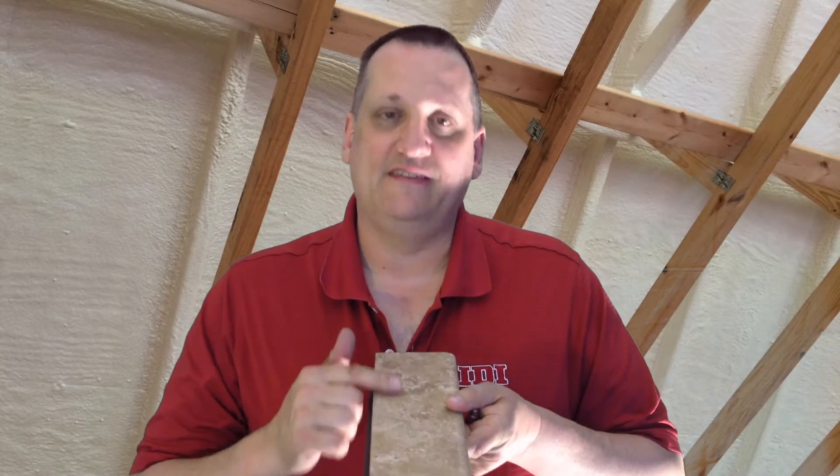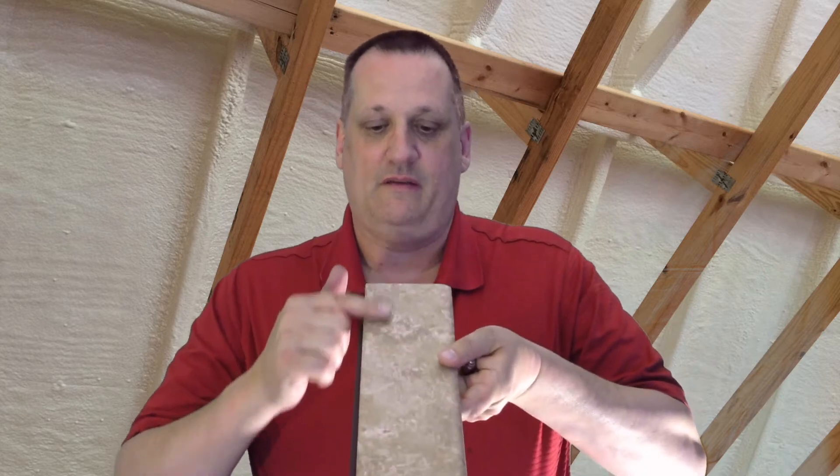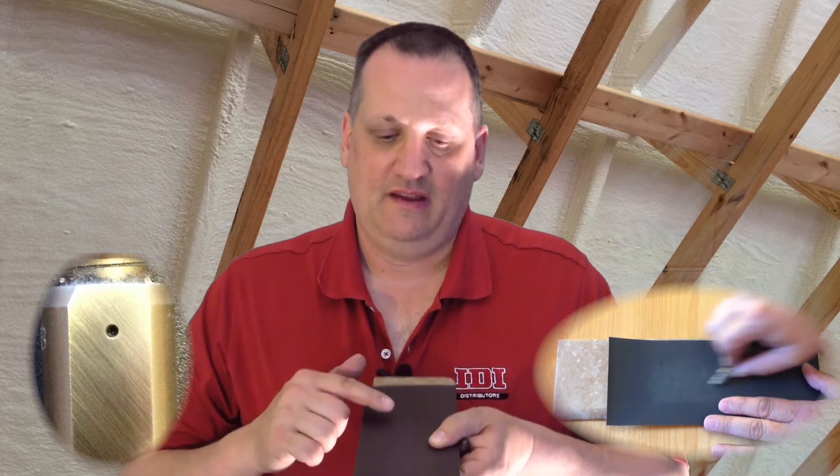So let me show you how to do it. I'm going to take a hard flat plate — in this case I have a tile that I make sure is nice and true and flat. We're going to also use a piece of hard glass, a piece of metal that's been machined on one side, or a piece of granite countertop sample. All of these will work. Now we're going to take some 400 or 600 grit sandpaper and put it on top of that plate and rub our mix chamber against that. That's going to keep the mix chamber flat and the 400 to 600 grit sandpaper is going to give us the right surface finish.